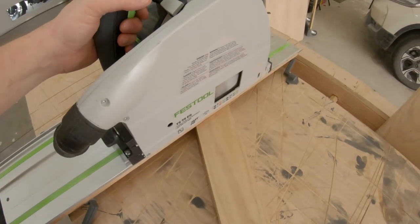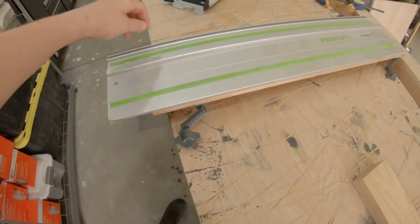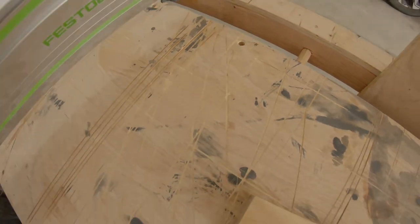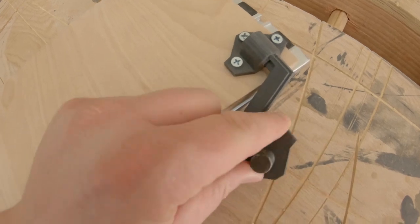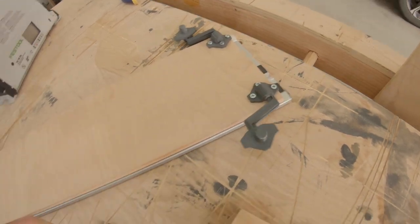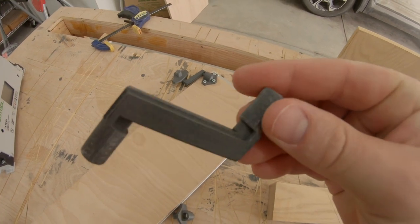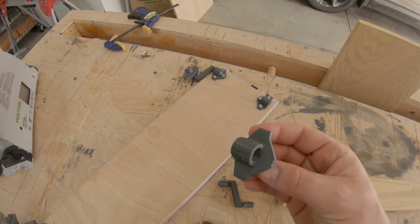It's super handy, but I didn't like having it permanently affixed, so I changed it a little bit and did pegs. You can get this out one-handed. There's just a hole drilled in the bench and a peg on the little lifts, screwed to the base or top but not screwed to the workbench - just friction fit. All the legs are perfectly symmetrical, there's no up or down, left or right, and the bases have either a screw-in or peg design.